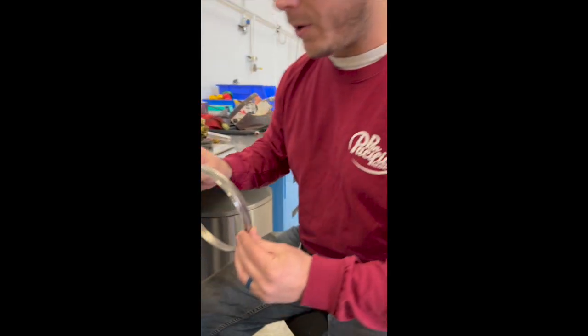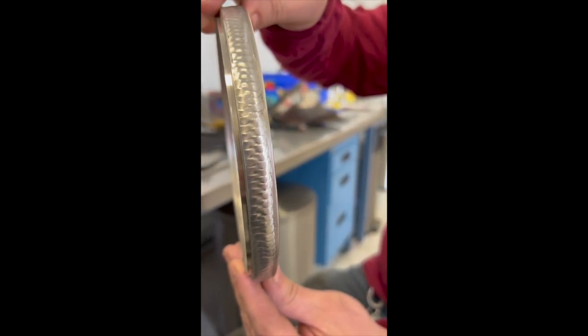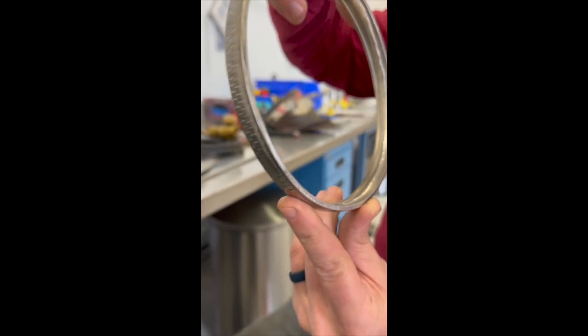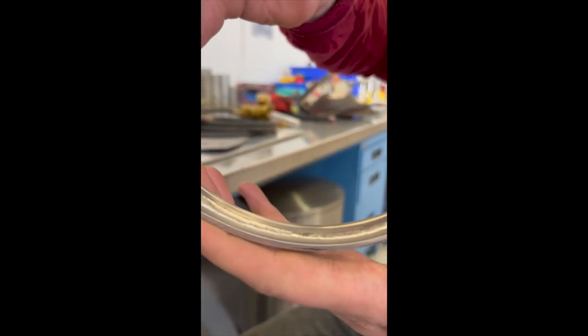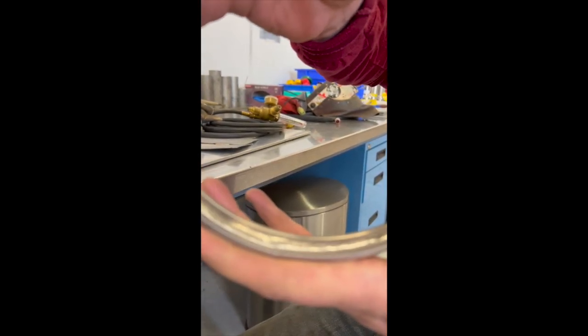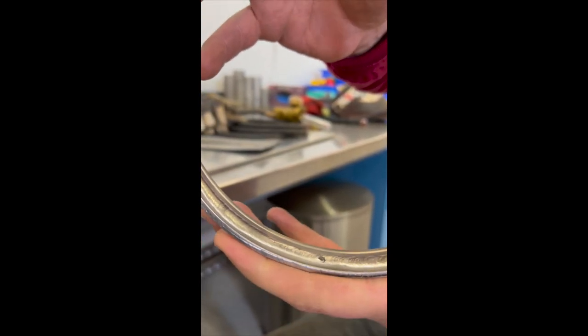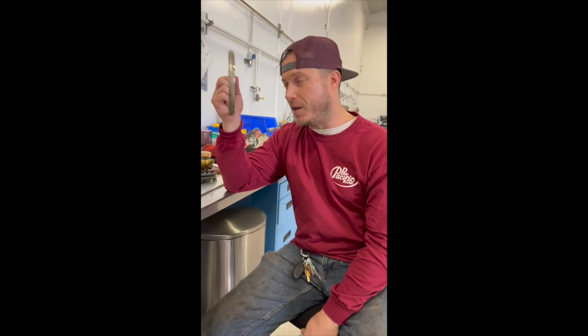And I have a demonstration here of a little weld that was cut out. This is the guy's cap, which is a real pretty cap, as you can see. And then if you look on the inside, this is the root pass. And he's got full penetration. He's under 1/8, and he's also got plenty of penetration, so that's gonna pass X-ray right there. This is a beautiful weld. You guys keep practicing, and I promise you at some point, you may turn out one of these bad boys.